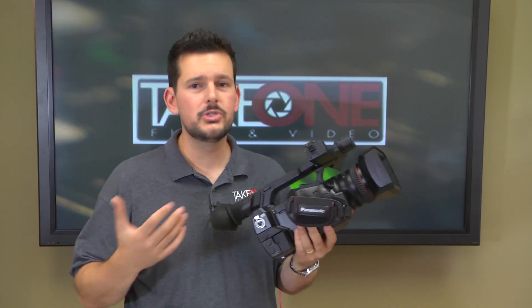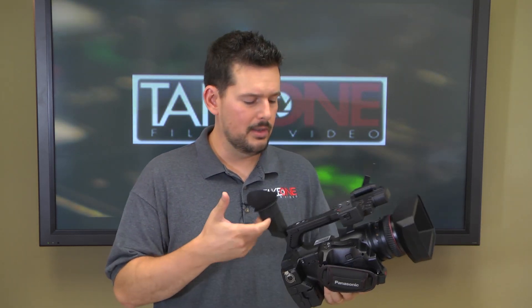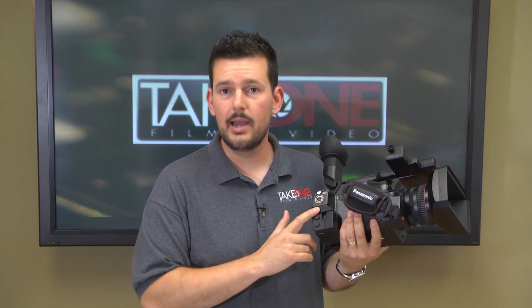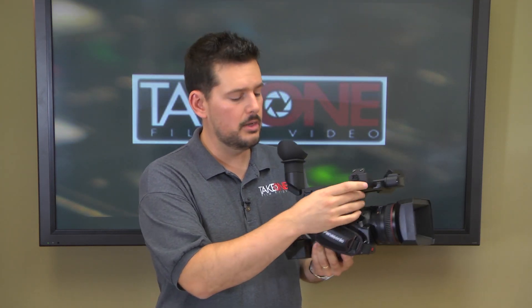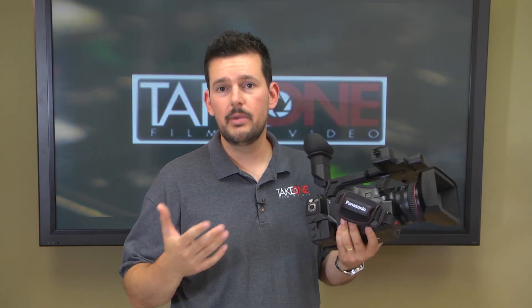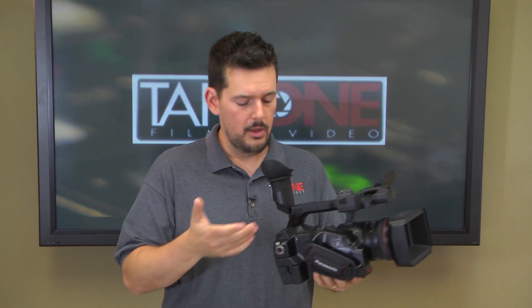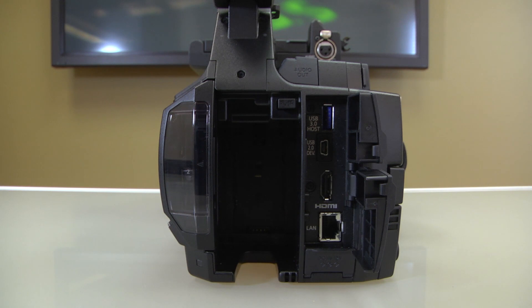One of the biggest complaints about the camera was just the general stability. They're small cameras, but they're still pretty heavy, with lots of stuff coming in and out of the back. Panasonic took that feedback and came up with a way to operate the camera in a much more stable environment by moving a few things around. All of the BNC ports have now been moved over to the side — SDI output, timecode, and genlock are all now on the side instead of the rear. The XLR inputs are repositioned as well: one up front for a shotgun mic, and the second input also on the side. The purpose is so you can put the camera up against your body and operate it in a much more stable position. On the back side, there are still some IO ports — USB, HDMI, and an RJ45 LAN adapter — but these are items we normally would not use in an ENG application while out shooting in the field, so they're safely tucked away in the back.